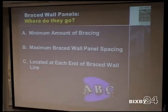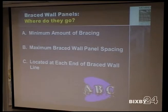so what do you do in that case? So if you have a wider span, you end up having to go with a different method. Not necessarily an engineered beam, because it says the header, it doesn't say engineered 2x or what, it says your header cannot exceed 22 feet, and it just says that on the CSPF method. It doesn't say that for the others, so I don't know if there is; that would be up to the designer who you'd be getting your lumber through to let them span it and see what they're spanning, because they're gonna be able to span it.